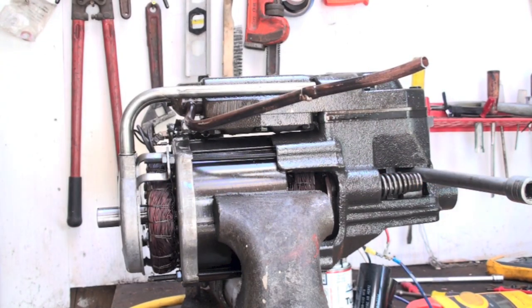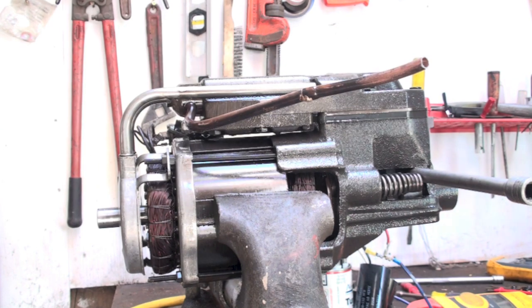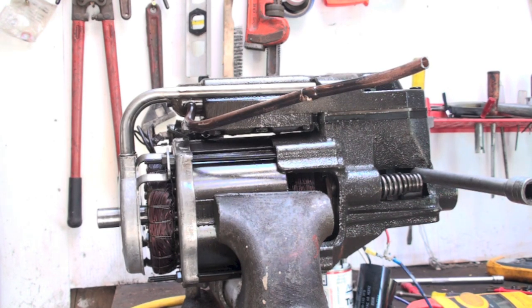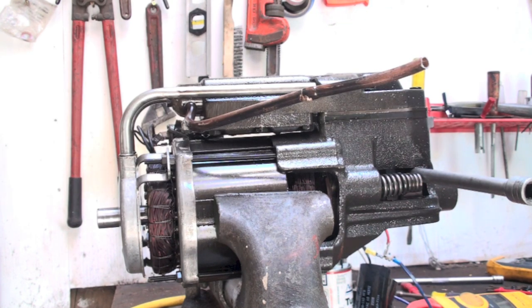Okay, I had made a comment about a start assist on a compressor, where people were putting hard start kits on their compressors, and I had heard from one of the manufacturers years ago that they did not recommend hard start kits. They said you could put them on if you had a TXV expansion valve or something like that, but they did not necessarily recommend you put them on because of the starting torque pushes the windings back.